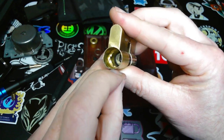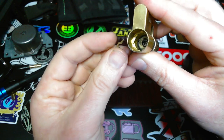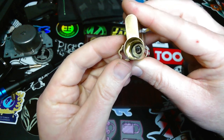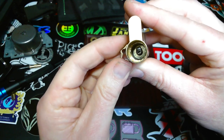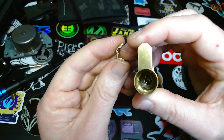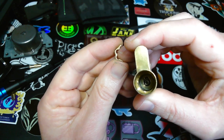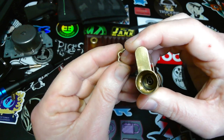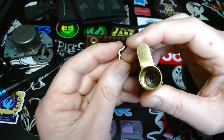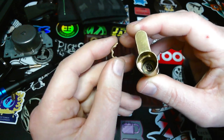There you can see those circles — that's where the sidebar rests. So when you try to rotate the plug, the sidebar can't rotate in the housing. Unless the sliders are at the correct position, the sliders won't be able to get past those parts coming in. And when they're in the correct position at the true gates, they can just slide past, so the plug can rotate. I hope I'm explaining it well enough — I think it's very ingenious.